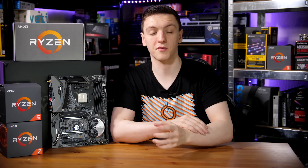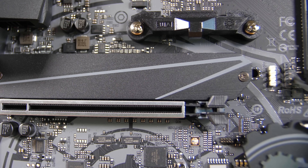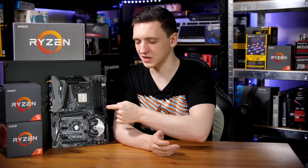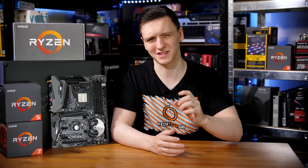One of the nice features that ASRock have clearly been thinking about with this motherboard is actually a couple of headers right next to the CPU socket. These are an LED header for your Wraith Spire and Wraith Prism coolers, and also a single USB internal header. This means that for all of your AIOs, like your Corsair H100 and H115i Pro, that all have a USB connection that normally requires you to go all the way around the board and ends up looking pretty messy, you actually have a USB header right here that you can connect to and cable manage much nicer.